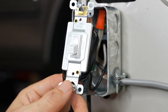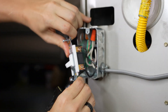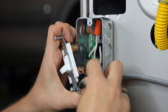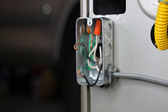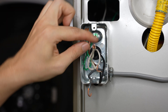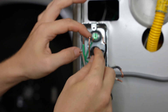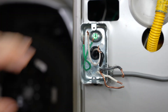There's some electrical tape around the switch — we can go ahead and pull that off to expose our connections. I'm going to go ahead and disconnect the two wires and take my switch out. After the switch is out, we can proceed with disconnecting the rest of the wires. I like to disconnect the power wires coming into the furnace and just push them off to the side.